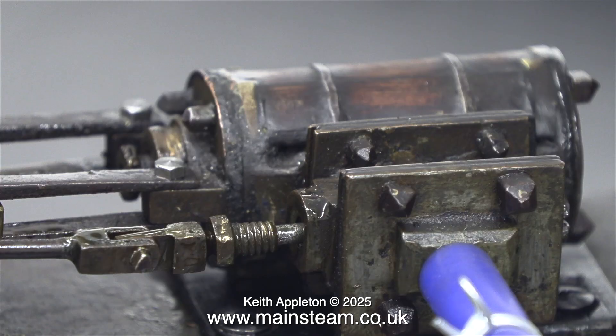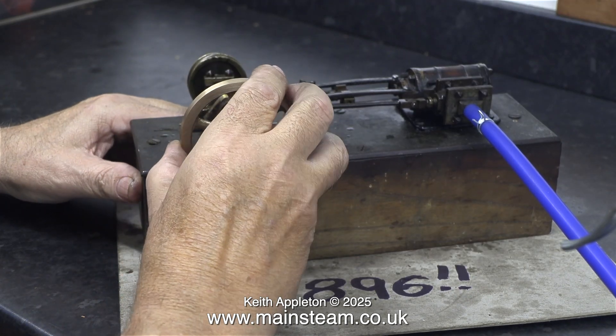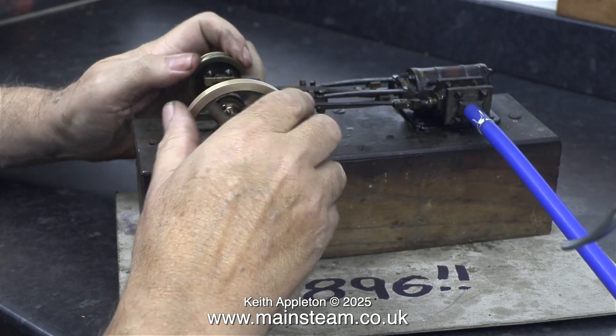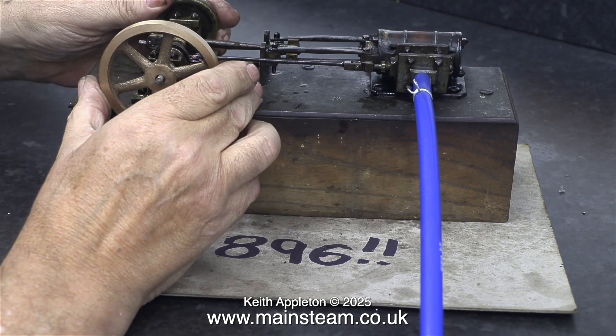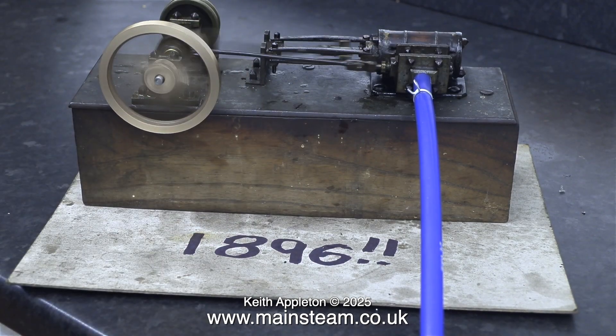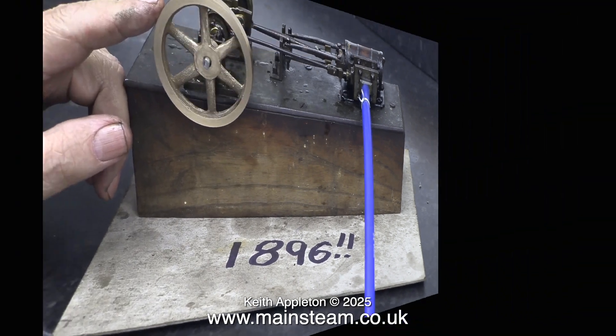It's starting to knock a bit now — the crank pin's getting worse. The steam chest gland was blowing, so I repacked it with a small amount of graphite yarn. The piston rod also needs packing, but I cannot get a spanner to fit the gland nut as it's too close to the crosshead guides, so for the time being I left it as it was. The crank pin and the crankshaft are getting really wobbly now, but because it's a steam engine it still works. And that's it for me, but it's not really the end of the series. I've had a word with James Evans, who owns the engine, and we've decided that a few modifications including a new crankshaft will be fine. Stay safe, stay healthy — thanks for watching, and I hope you found it useful.